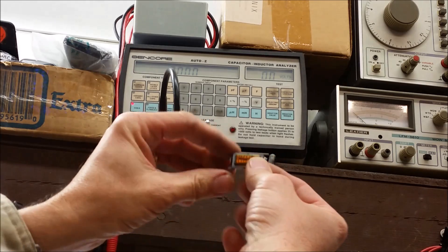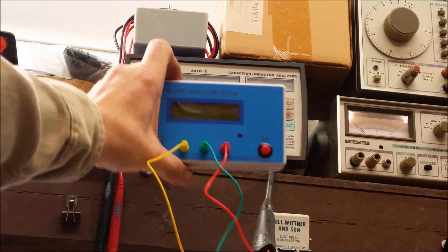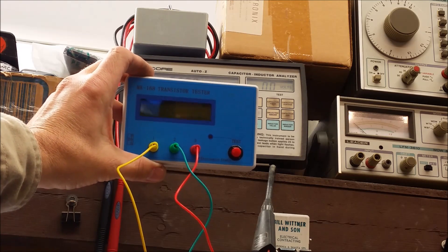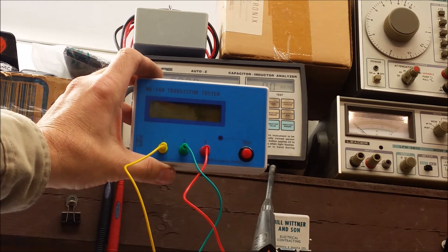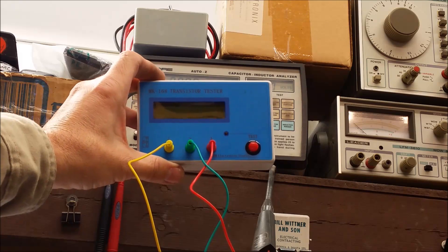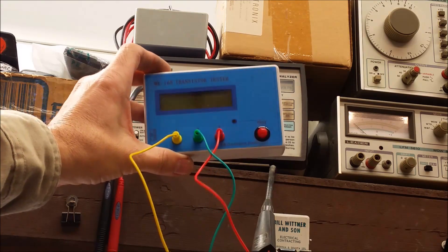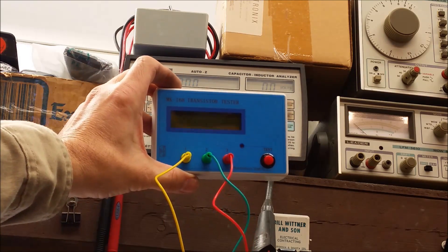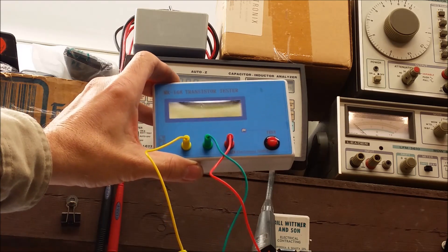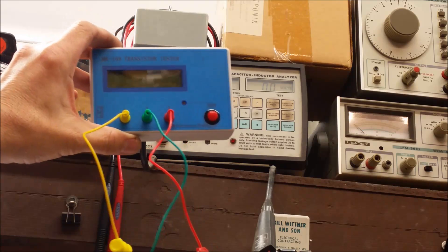What the inductor ringer does is it sends a pulse into the transformer and counts the number of rings — the times it oscillates coming back out. It only rings three rings. So by process of elimination, I think I can safely say that this transformer is most definitely the problem in this set. Between the capacitor-inductor tester and this little transistor tester — which incidentally will test transistors, FETs, IGBTs, capacitors, ESR, voltage loss, voltage absorption, actual capacitance value, resistors, diodes, and some silicon-controlled rectifiers and triacs (but not all, depending on gate resistance) — these are a couple of handy little items to have. My buddy up in Oregon, Dave, did a video with the inductor ringer, and you can pick up an inductor ringer quite cheaply. Between the two different transformers, it will certainly tell you which one is good and which one is bad.